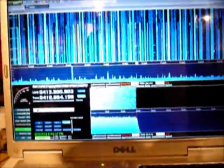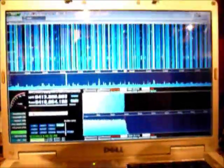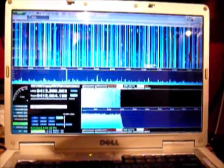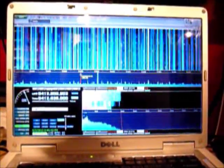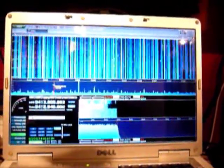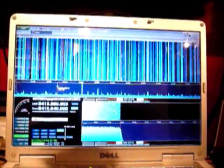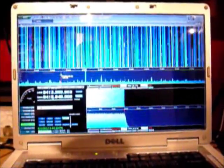I've moved down to 412 MHz. This is our local LTR trunking network. This network unfortunately is not as active as the Motorola network. There's a lot of digital stuff going on — control channels and other things like that. However, it's not overly active so I'd probably have to sit here for a while to actually pick up any analog voice that we could listen to.